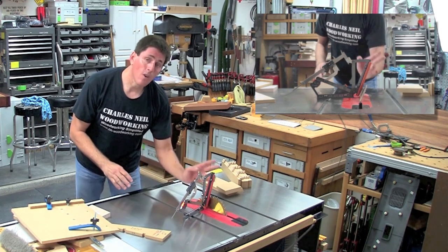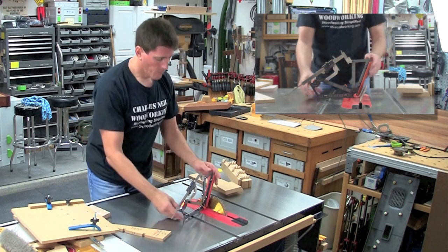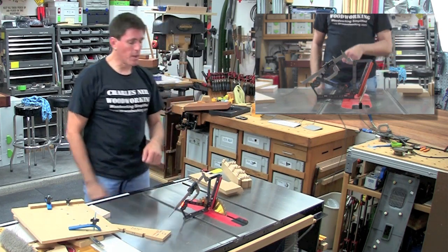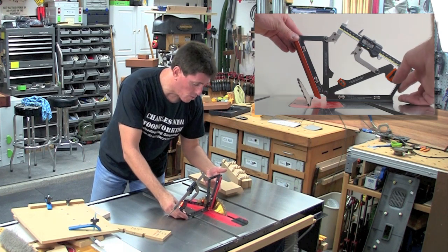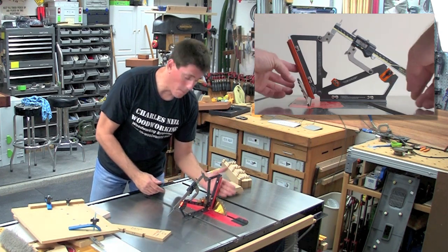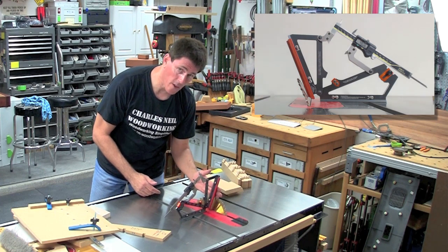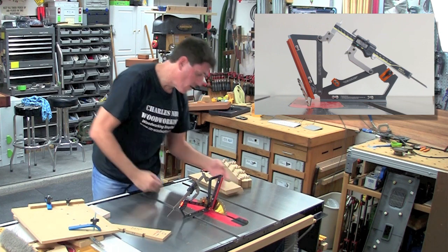When you're skewing this, you're changing the angle so that it's actually going to be less of a tilt. So just eyeball it to 90 degrees, make sure there's no tooth in the way, make it touch the blade. When it touches the blade, because it's magnetic, as I change the bevel on the blade and I move it up to match this tool, it's going to push this over onto the table, and it's going to keep a nice snug fit. It makes it super easy.